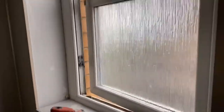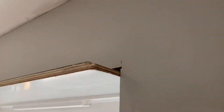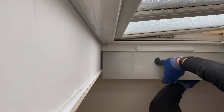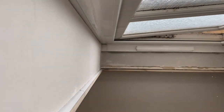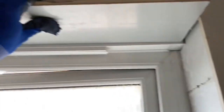So the easiest way I found to scribe them in, obviously, is they're not always straight down the edges. So what I'll do is I'll cut it to width. So I get that in there like that. It's quite hard to do with one hand. You can see it's obviously a lot longer. And then obviously I cut it 5 mil. I'm gonna have to put that down. So I just cut it, always never cut it flush, so just over. So I know that pencil line along there is gonna give me the 5 mil that I need. So I'm gonna cut that off, and then that should just slot in there perfect. Just a few mil over and get that trim ready for that one, and then cut them sides up.